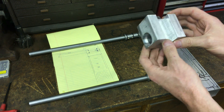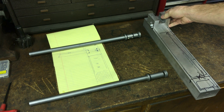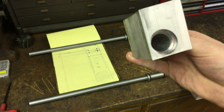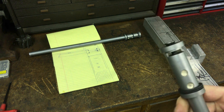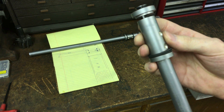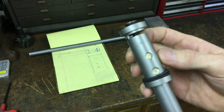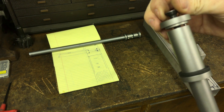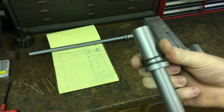Just imagine this is gonna be the keyboard — there'll be one — and then the monitor is gonna have one up here. This has got a fifteen-sixteenths bored and reamed hole and some counter bores on the end for these pieces of tubing. There's a sleeve we turned that goes over them, and that sleeve was silver soldered or brazed on there — whatever you want to call it. If it were TIG welded it would be like a rosette weld or something — but anyway, I digress.